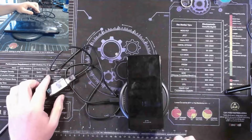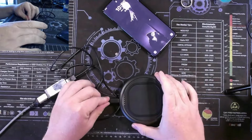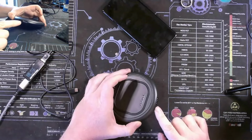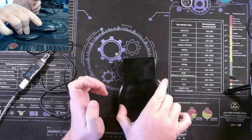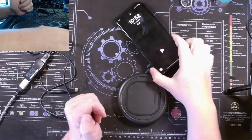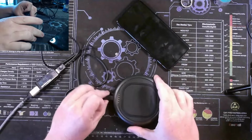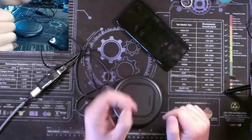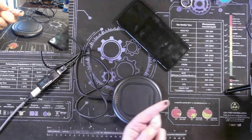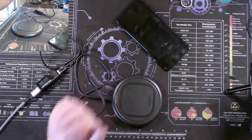Well, now I want to test it with it unplugged, just to make sure that that battery can still work. Okay, got a light there. Yeah, and it's still charging. Other than stacking it, there's nothing much more to test. This seems to be working. And the issue boils down to our PMIC IC that you see right here. That's where our short was at.